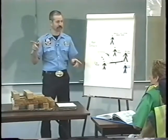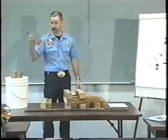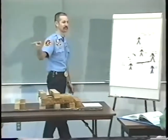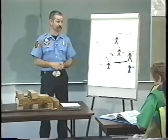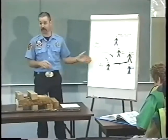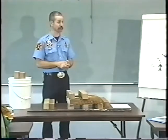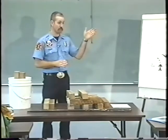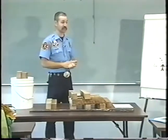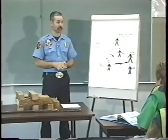Okay, Penny and Rachel, what you will be doing is supplying the cribbing builders and the fulcrum builder, which will be Brandy, with the materials that they need to build their cribs. There's one person we don't have on here today, with the limited number we have in the classroom, and that is our safety person. Today, as the instructor, I will be acting as the safety person. The safety person is responsible for watching the overall operations. If we see an unsafe act or a problem that's about to occur, we will shut down the operation.